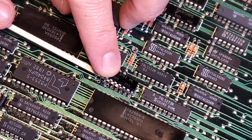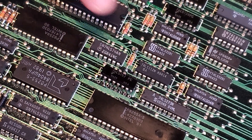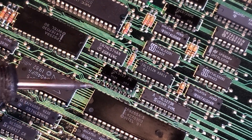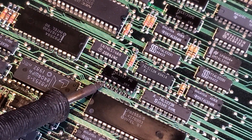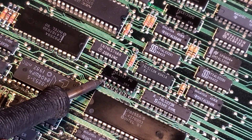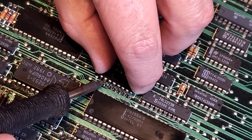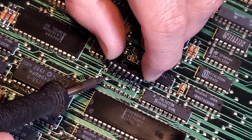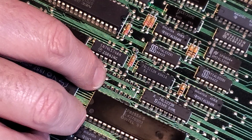This is why you have to be careful. Even after soldering and desoldering it twice, I still managed to leave a little bit on the leg. The camera wasn't really helping my situation, but when you're working on this, be very careful. In my case, the wire was easy to trace, so I just opted to use a bodge wire on the bottom of the board.